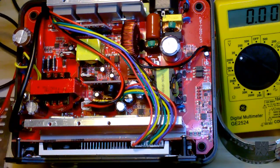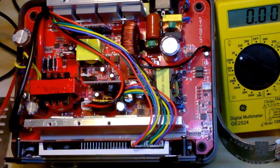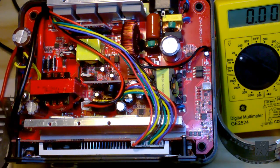So on the left side we have these large wires, and they come up to some very large, I guess they're lugs or mounting places on the motherboard or main board. And obviously you would expect that if this unit was functioning to some degree, there would be a voltage of approximately 11.1 volts on those terminals. Now this system has a 3S lithium-ion battery pack. I think it's 10P, so 10 parallel. They're just 18650 cells. So you would expect a voltage of around 11 volts or so.